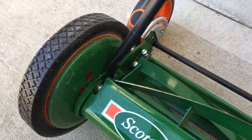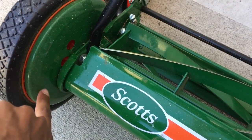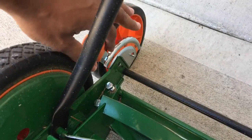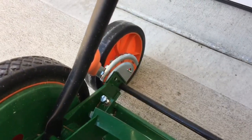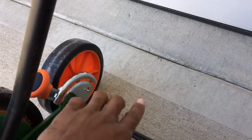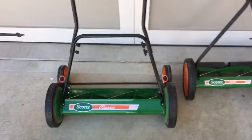You make the physical adjustment to get the coarse height you want. If you want to cut between two inches and one inch, you set this to the lowest — you can see there are three holes. The lowest one gets you the lowest coarse cut. And then once you're there, you can adjust among the settings to decide how high or how low. If you have certain parts of your grass where it's thicker and you're not quite ready for full low, you can move it up to medium and make a pass there to get that cut down. As you keep cutting, you can slowly work it all the way down to full low.